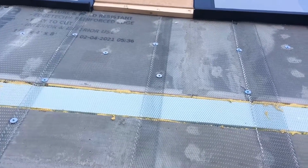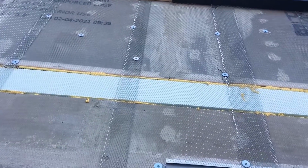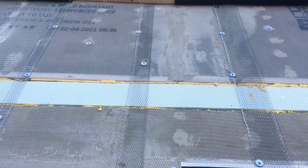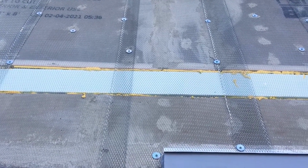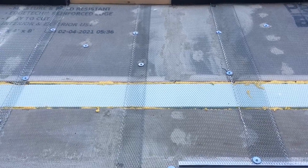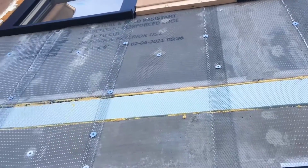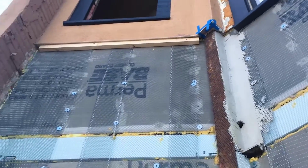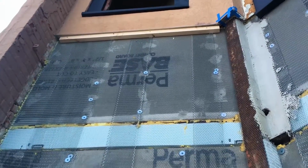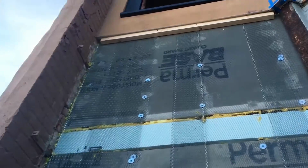And that drip edge is gonna help shed the water out over that, so we avoid that problem that we had before where the water was getting in, infiltrating behind that foam backing, rusting out the old wire mesh and popping that original parging off of the wall. So hopefully that drip edge does the trick and gets nice shed out of the water over the parging and everything drains right.